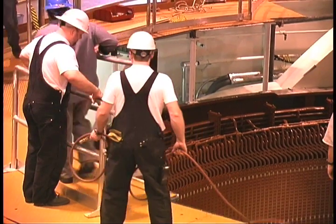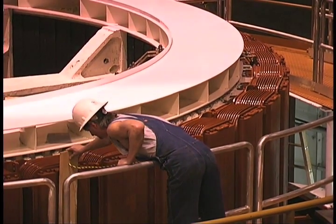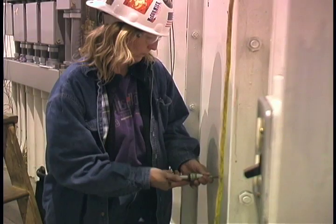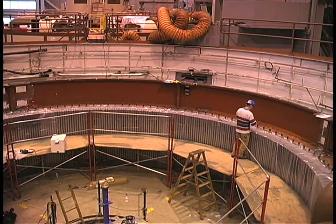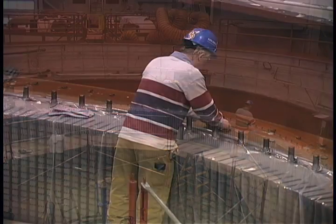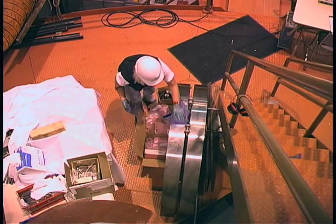This is at the end of the refurbishment. The delicate dance was already performed once before, when the rotor was pulled out of the generator. Tearing down the machine took a couple months. Julie Knopf is an electrician constructor who has been working on the rebuild with other City Light workers and a specialized outside contractor since April 2004. We're rebuilding the inside of the generator — they're re-stacking the iron and we're getting all new coils, which is how they produce the electricity.